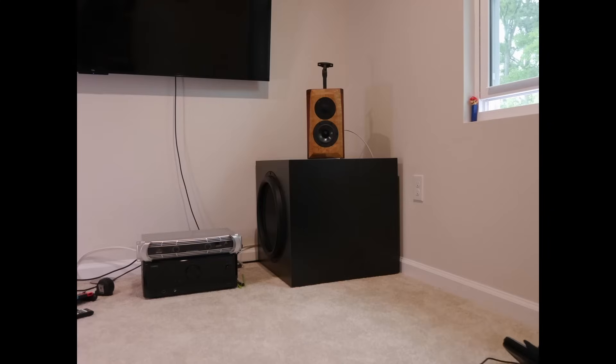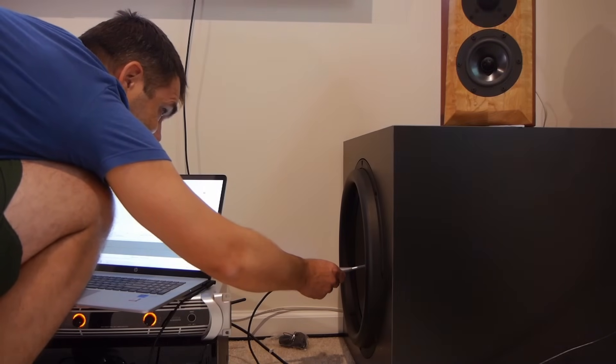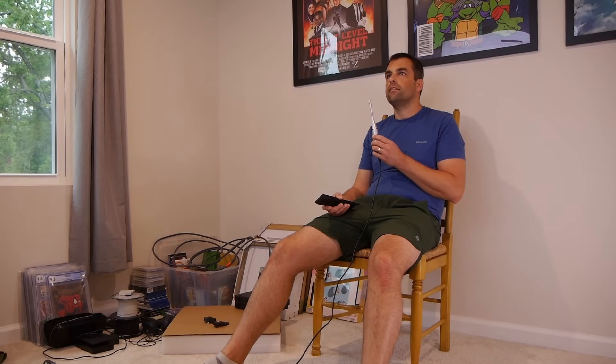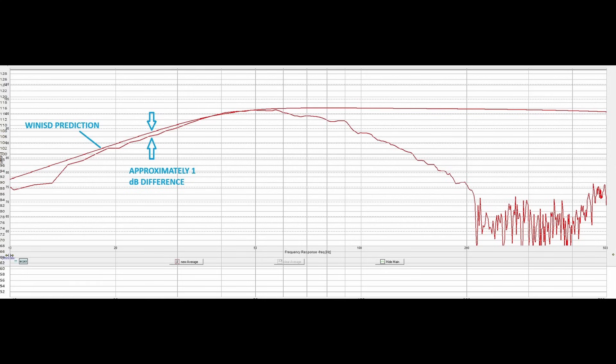This is the location I'm going to put the sub in. Here I'm taking a near-field measurement to get my baseline anechoic response, and then an in-room sweep. The anechoic response from the near-field measurement shows a 200 Hz crossover on this thing, getting about 13 dB per octave, which is good. The box isn't ginormous and it's not fully broken in, although I wouldn't expect much more from further break-in. It's hard for sealed drivers to do 12 dB per octave — often we get less. Compared to the WinISD prediction, we're down about one decibel.